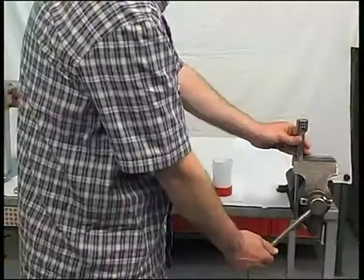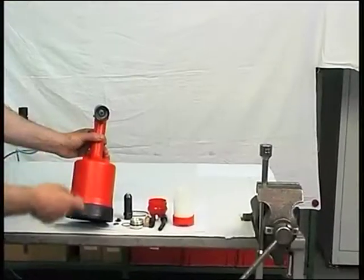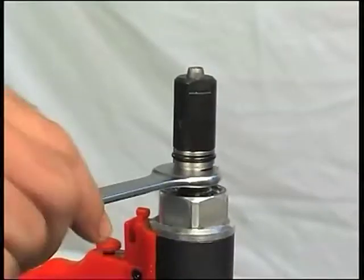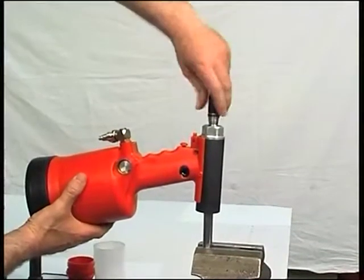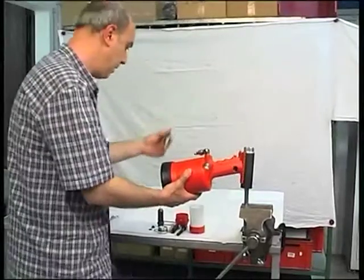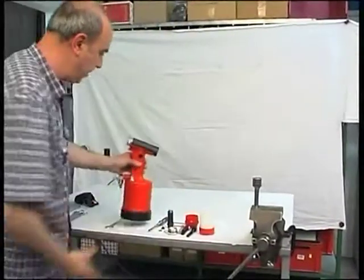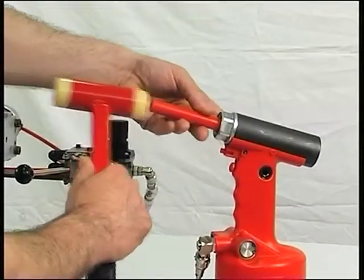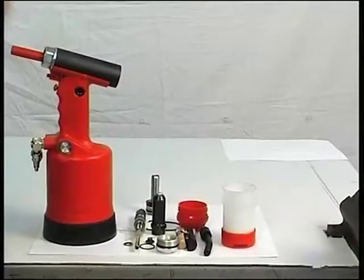Fasten a 22 mm socket wrench in a vise, then fit the hexagonal seat of the piston, figure 18, into the wrench. Use a 14 mm wrench to unscrew and remove the cone holding head assembly. Use a plastic tube and a rubber hammer to tap the front side of the group to make it exit from the rear side of the hydraulic cylinder, figure 24.